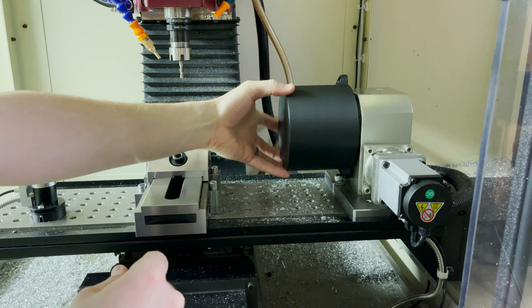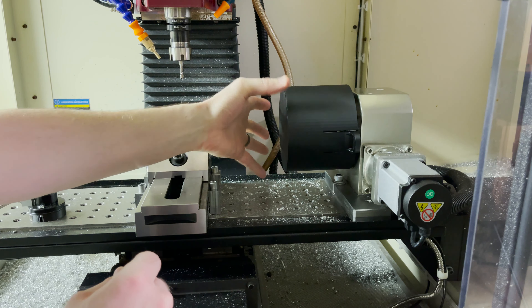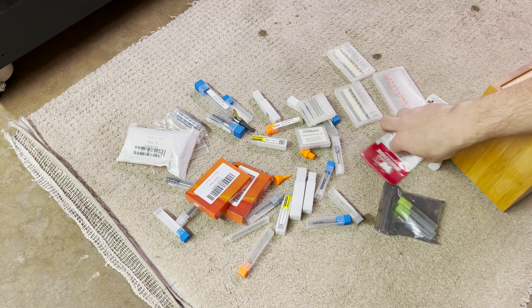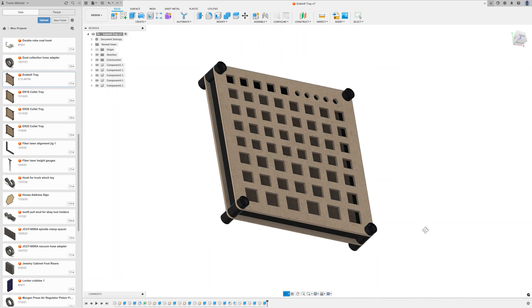Here's the design I came up with in Fusion 360. I'm going to 3D print the black base and then laser cut the stainless steel top plate to conceal the mounting holes. I have a new roll of black PLA so let's load it up so we can print. I export the model from Fusion so I can import it into QIDI Slicer. I've sliced the model and everything looks good, so let's send it over to the printer via Wi-Fi. This is my first time using the new QIDI Slicer — I believe it's based on Prusa Slicer, and I really like how it has the integrated Fluidd interface. It makes remotely interacting with the printer really simple. I guess we've got about 7 hours and we'll see what happens.